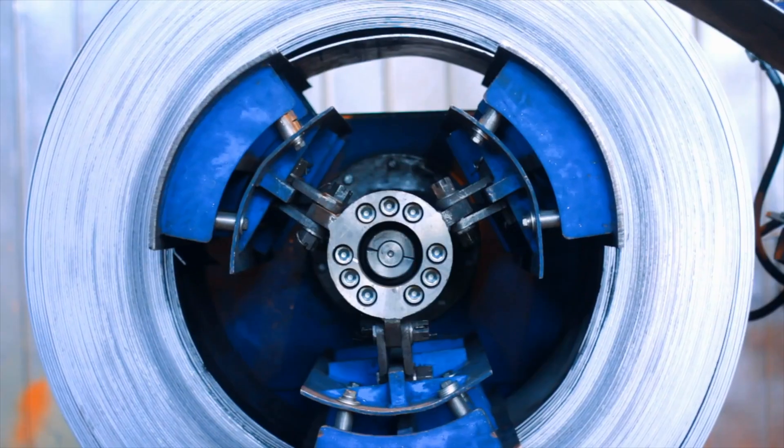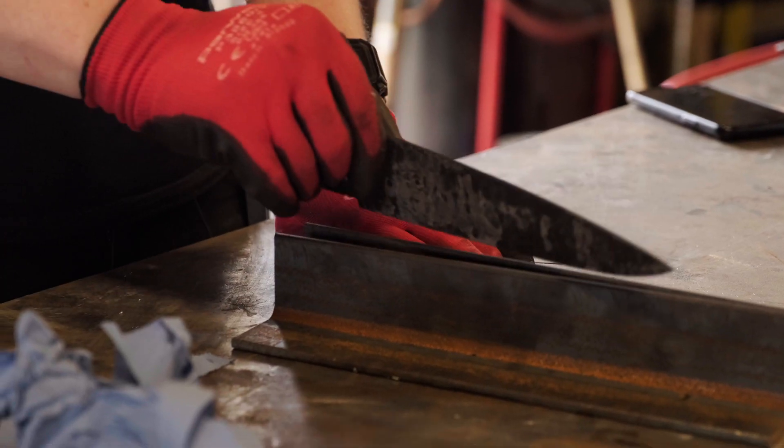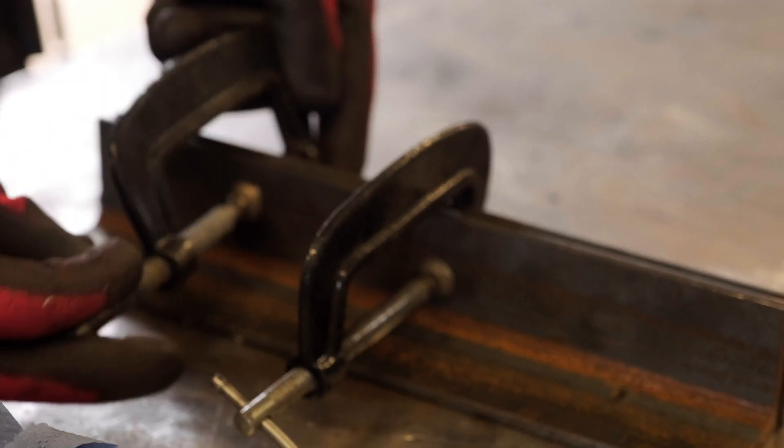I tell you now, sometimes I put knives into my press — they've come out of the hardening furnace, gone into that furnace dead straight — and they can be bent up five millimetres at each end, particularly some of the stainless steels that come in from overseas on a coil. Press it flat, let the transformation within the steel go through the hardening operation while it's pressed flat, and they generally tend to come out flat. It is a bit of a faff, but for those with plate quenching facilities, you can experiment with that. It's the method we use here for our heat treatment service and we normally get stuff fairly straight.